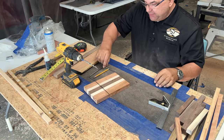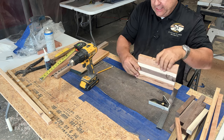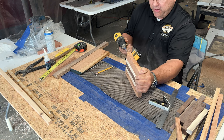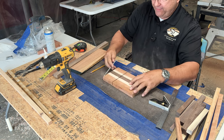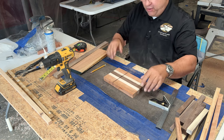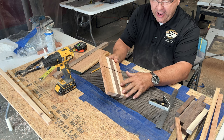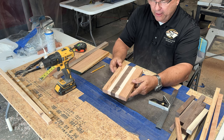We're back at the assembly table. I brought the drill bit from the drill press over and put it into my drill. What I like to do at this point is just take my drill and come through here and just clean this hole out a little bit — just so that whenever you take your handle and test fit it, it's going to go in nice and smooth, just like that. You can imagine how simplistic this would be once you start working on say 10 or 15 of these right in a row — it's like an assembly line. It goes very, very quick, and you can make these out of just scrap from your shop, whatever you've got laying around from other projects.